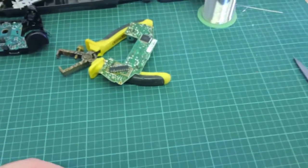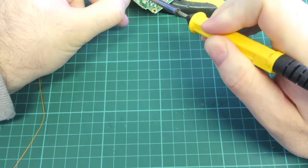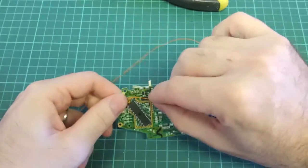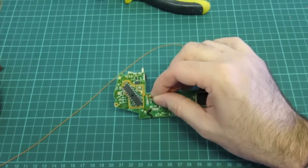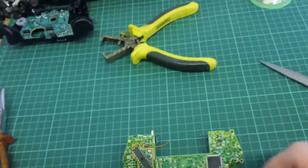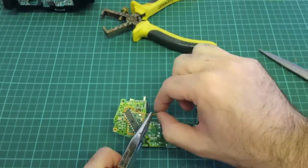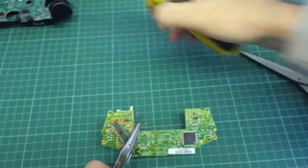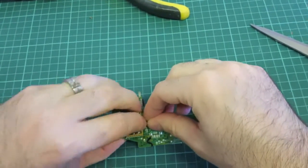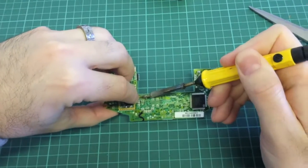The first connection is to the top — this is going to be our earth or ground. When routing your wires, place them where you want them to finish and then cut them to length. Make sure you've got enough wire so it's not being tugged. When stripping your wire, use a pair of nose pliers so you're pulling against the pliers, not against your solder connection. Layer the wire where you want it to go, add a bit of solder — job done.